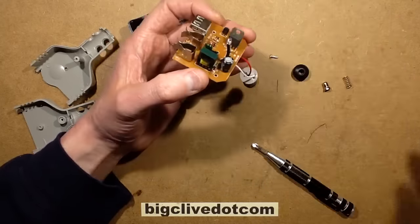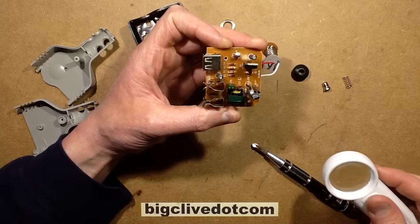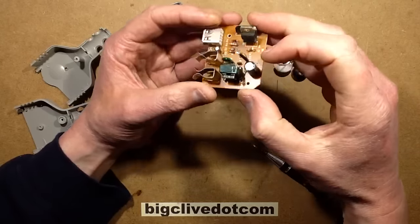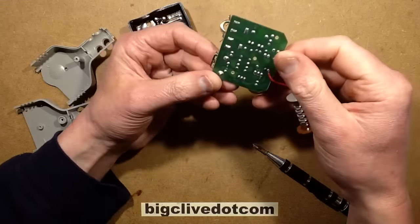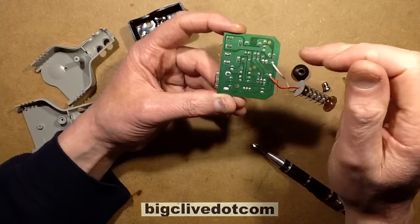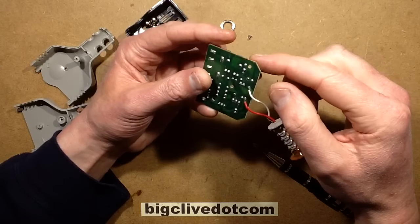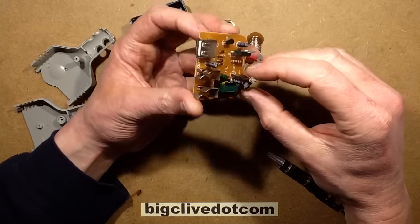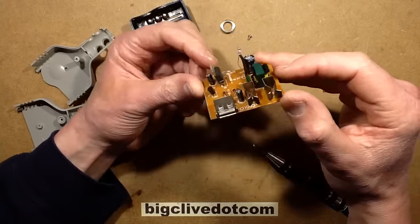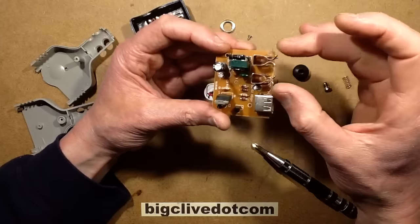This transistor here is a TIP31C. That's not a Darlington — it's a generic transistor, must be forming an oscillator with this transformer here. One output goes straight to one of these connections — it's actually a reference to the negative supply. The other output goes through a diode to this capacitor, marked Chong X or Chang X, which is rated 2.2µF 400V. So that's the capacitor doing the smoothing of the output — it is just putting out DC.